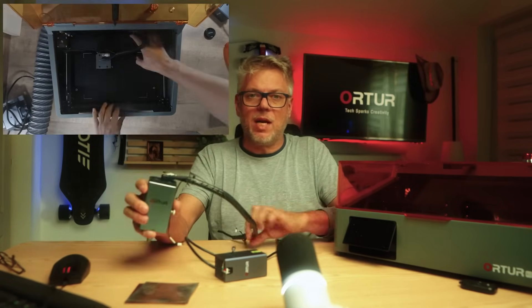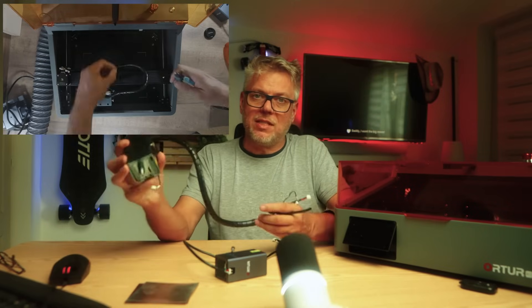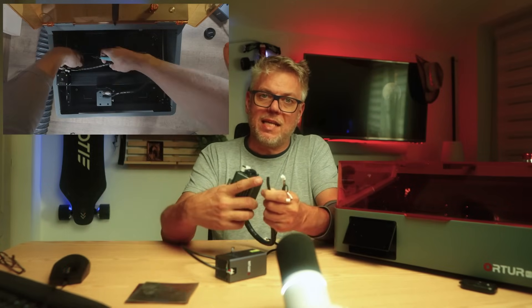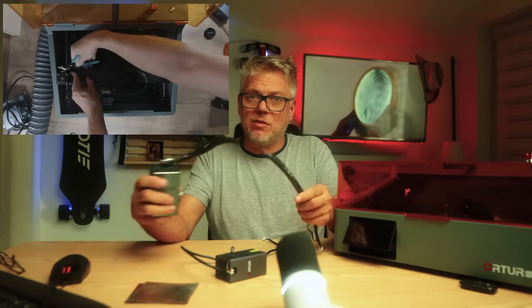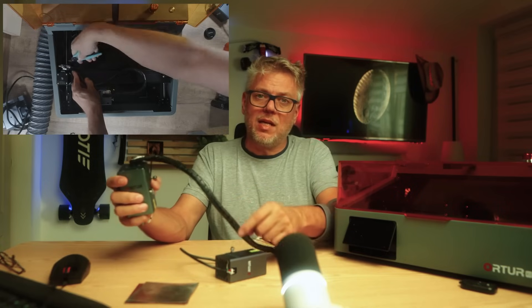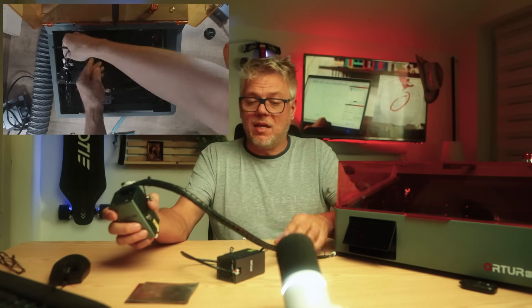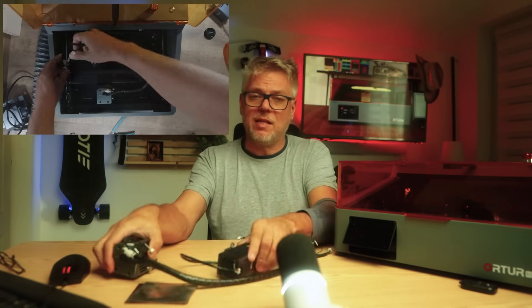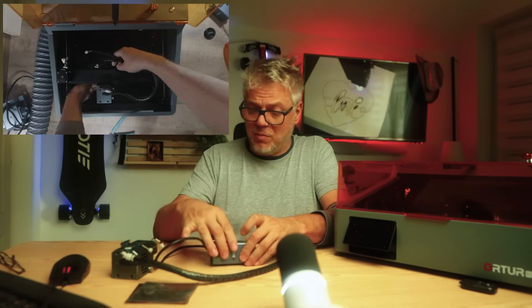Let me explain how to install this head into the machine. This is the one thing that a lot of people have complained about, because the original blue laser head is pretty heavily wired into the machine. There are two cables on this side and one cable on this side which need to be disconnected, and there's also the air assist tube inside the machine that needs to be detached. On top of that, this cable is also fastened to the rail — to the bridge where the head moves — with zip ties so it doesn't get caught on anything, and those also need to be cut off.